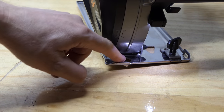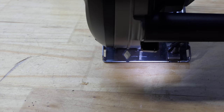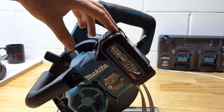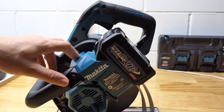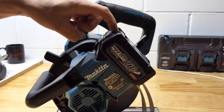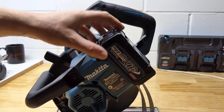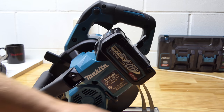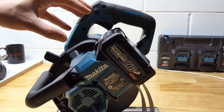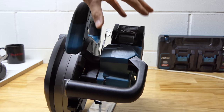There's an LED light here on the front which shines down through a diamond cut into the base, so you can see the line through the base — you just line up your line with the groove in the front and the two points of the diamond. If you're familiar with Makita 40 volt circular saws, you'll notice the battery is on a different orientation here — going vertically this time instead of sticking out the side or lying flat on the bottom. I like this because it means nothing is sticking out to the side; with some other tools the batteries get wider and wider and clash when doing cuts against straight edges. With this layout the battery extends upward, which may be a problem with the 8 amp battery as it'll be quite high leaning over with the handle.